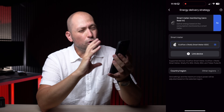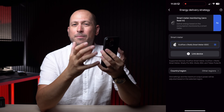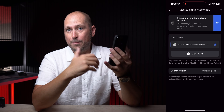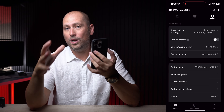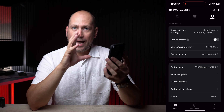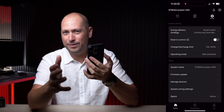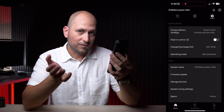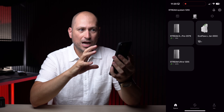For smart meter monitoring, you don't necessarily need the smart meter, but with it installed the system runs more efficiently because it better knows what's using power and when, so it can output more from the battery packs. Depending on your location, the system can output somewhere between 600 to 1200 watts to your house — each country has a different limit. Italy has a 600-watt limit, Spain and the UK around 800 watts, and some places allow up to 1200 watts. The app automatically knows the limit based on your location.